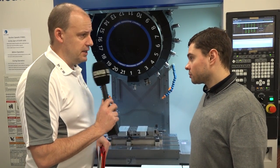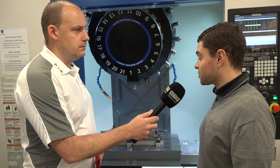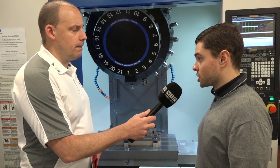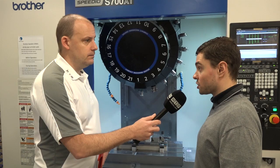And before this investment you didn't have through spindle coolant and again that's another aid to production isn't it? Yeah, exactly. This is our first machine with through spindle coolant and we've really noticed a difference on small hole drilling. We're achieving feed rates that we never thought we would be able to with small drills. So you're clearing swarf away as well at the same time as you're machining, which again helps? Yeah, definitely, and the swarf management is very good on this machine as well.